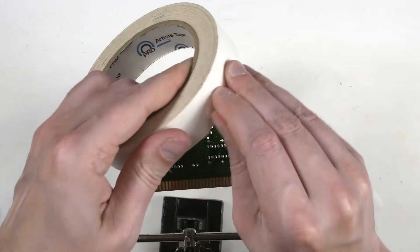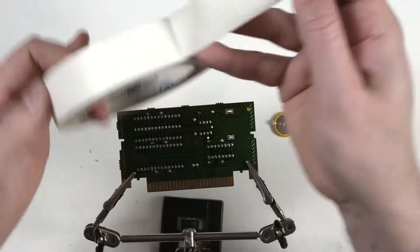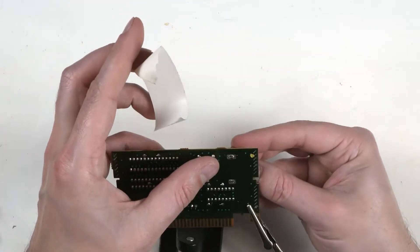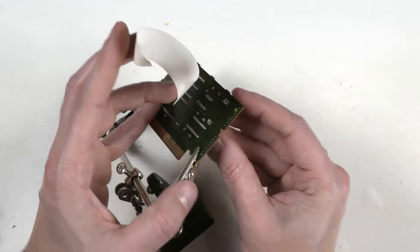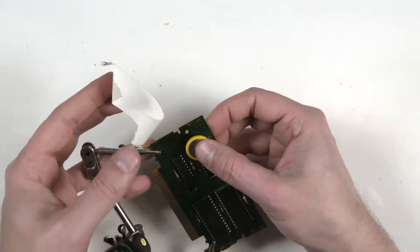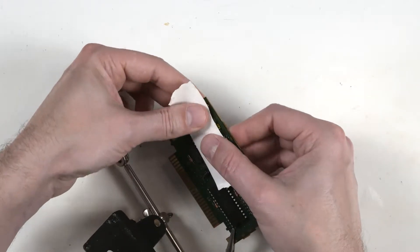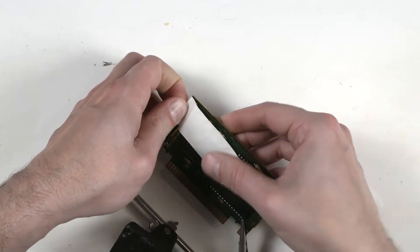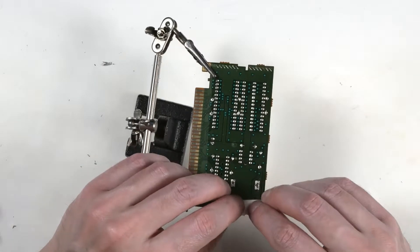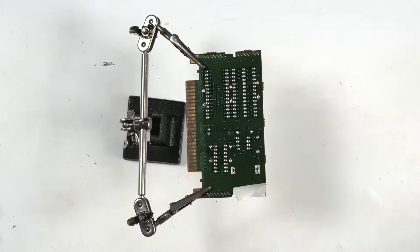Since the battery won't stay in place for us, we will grab some artist tape. I like to use paper-based tape to hold my components if they're not being cooperative, because plastic tape like scotch tape might melt. Remember, you're dealing with solder and heat here. Tape that down a little — peel it back so I don't... yeah, it's paper-based, but that doesn't mean it won't burn or stink up the house.